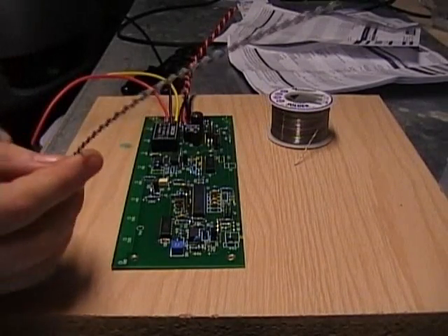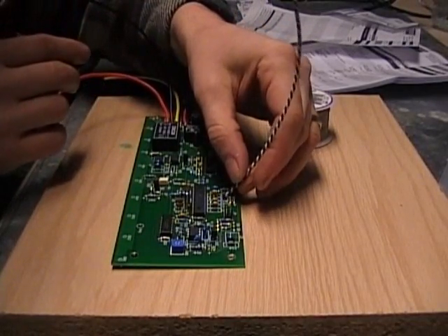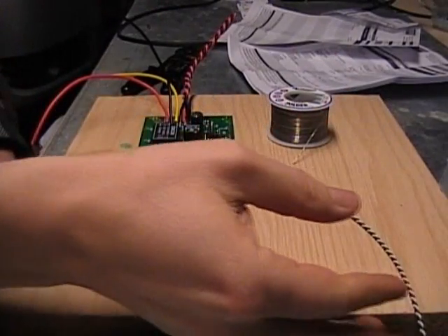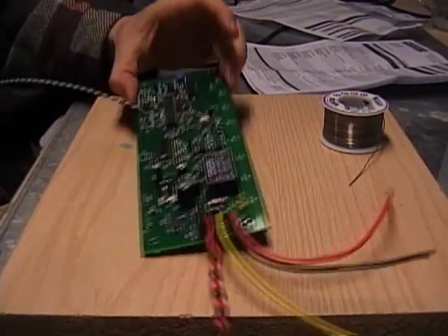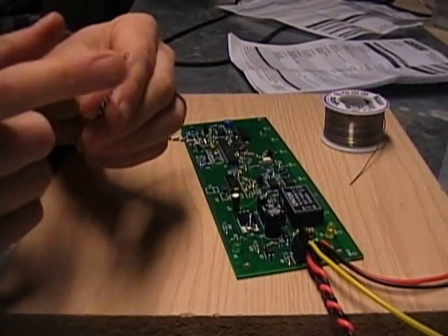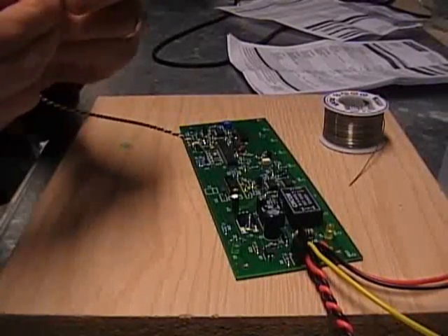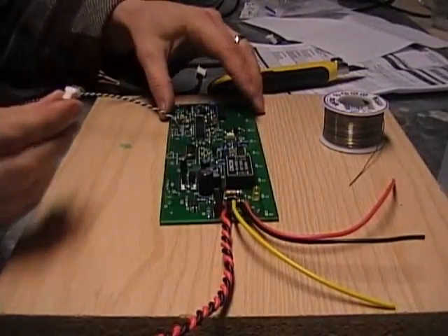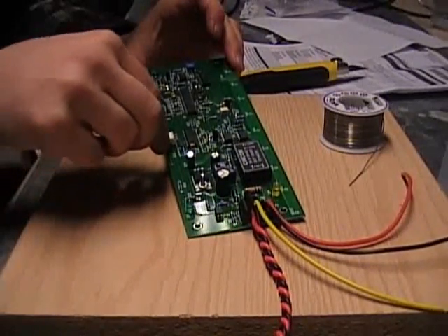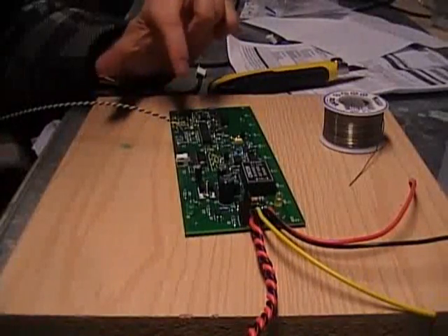Here's an example of what you would need to solder into RT1 — the other end is where you would solder the temperature sensor. Here's RT1 soldered into place; you'll need to add the thermistor on the other end. Solder one leg to each wire — it doesn't matter which one goes where. Only J2 needs the little angle connector thing, so go ahead and solder that in. J3 really needs a reliable connection, so it's better to solder the wires straight into it.